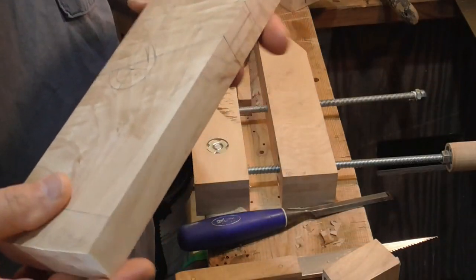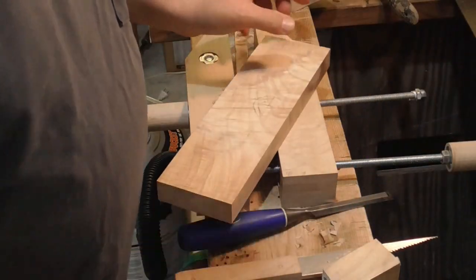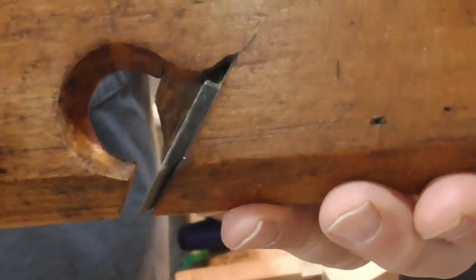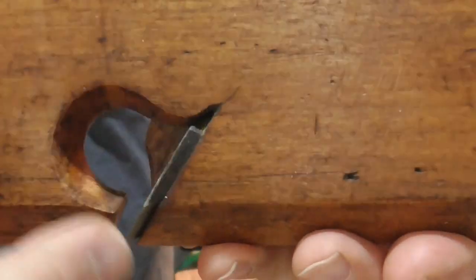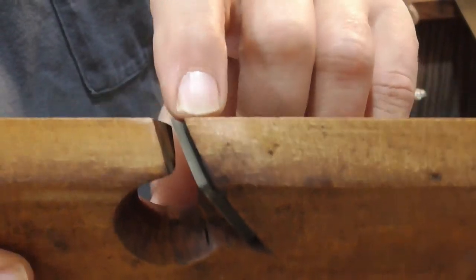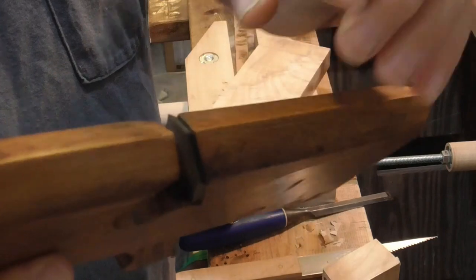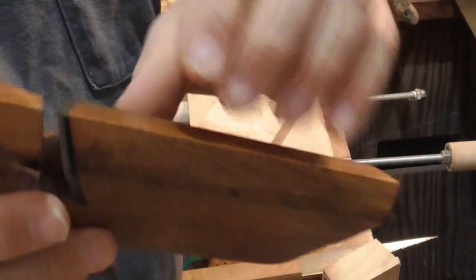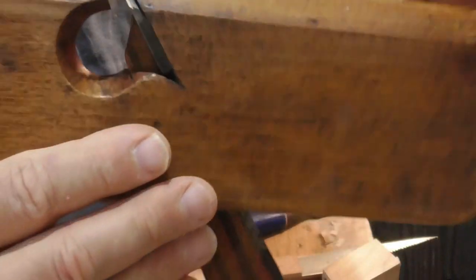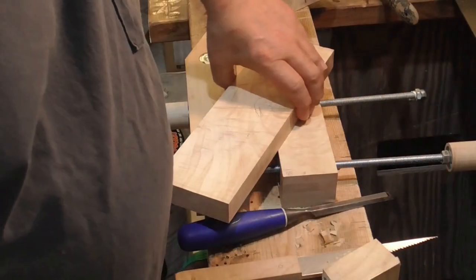I have a layout on it. On the original, it's basically what I would call a center escapement — it's symmetrical on both sides because the focus of the cutting action is right in the middle of a plane. If you were to set it pretty deep, you might need chips to come out from either side, so the escapement is the same on both sides. That's the way I have it laid out here.